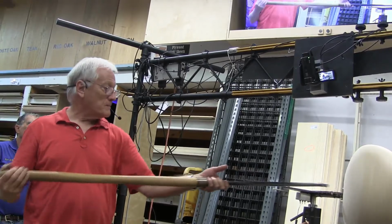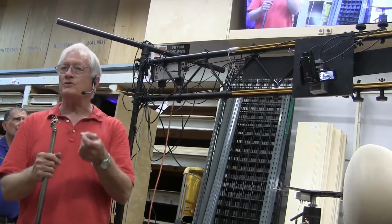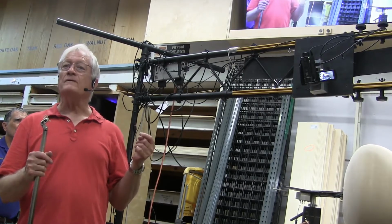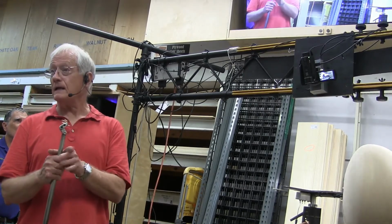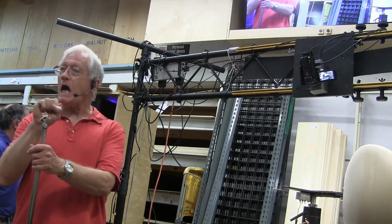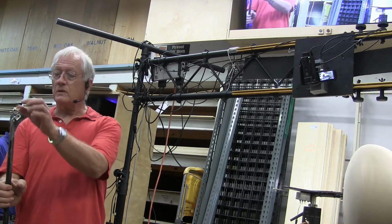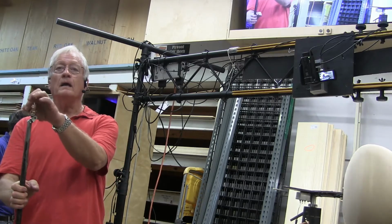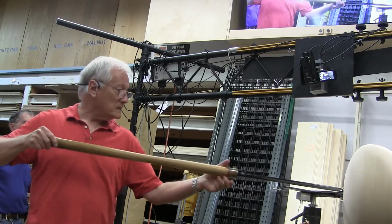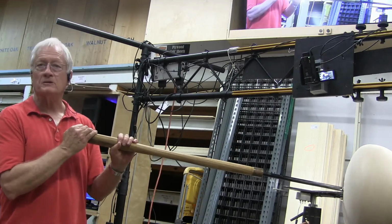But one thing about the Raleigh Monroe is this is a pressure cut system. If you overly finesse the Raleigh Monroe, or I think any of the shielded cutters, you're going to get into trouble really, really quick because they clog and they stop cutting. You can see that this one is totally clogged, but it's still going to cut because with the pin there, I'm putting tremendous pressure against this.